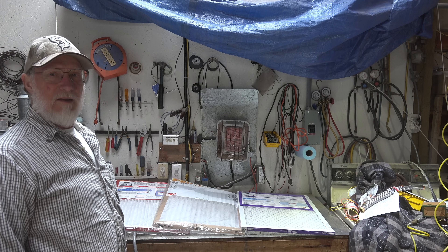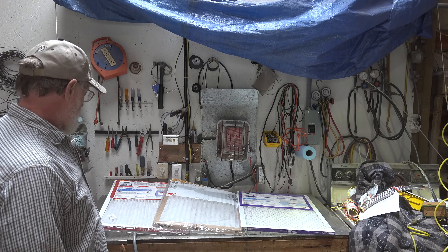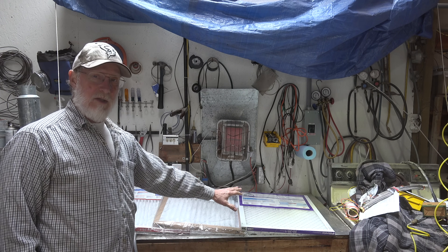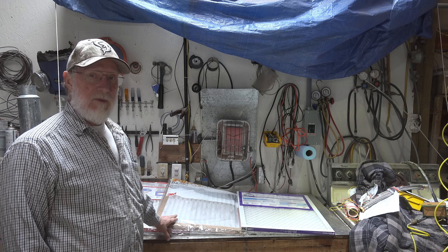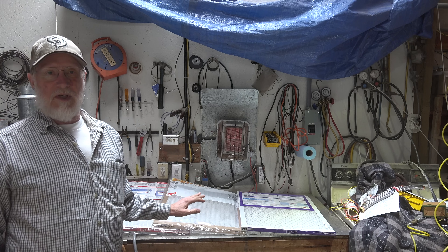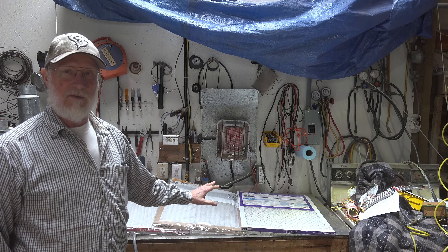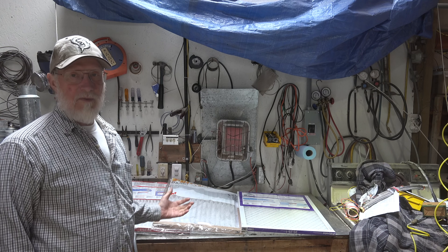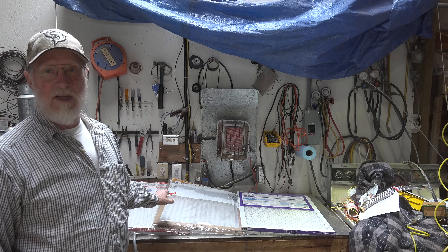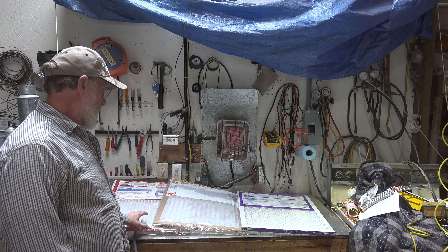In some earlier videos I've talked about doing some tests of furnace filters, so I'm getting started with this test. I'm going to put these different filters into a furnace and check the pressure drop across each one. This is important because many of the new filters we're using now have a very high pressure drop, which cuts airflow through your furnace and can cause overheating. Air conditioners tend to freeze up without enough air; furnaces overheat and shut themselves off. The most common furnace failure is overheating from lack of air — usually a plugged filter.